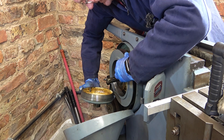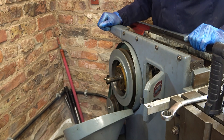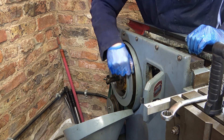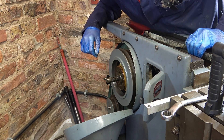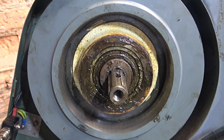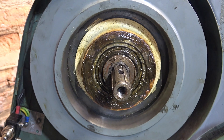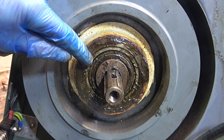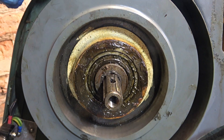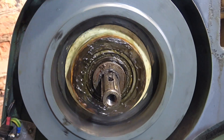That looks a bit grubby in there - it can have the bearings changed for its 60th birthday. Snap ring - sorry, this is handheld camera work. Can you see the problem? When I rotate this, the bearing outer turns, but the bearing inner turns a bit as well. There are two bearings - this one and one at the back as well. It does turn, believe me.